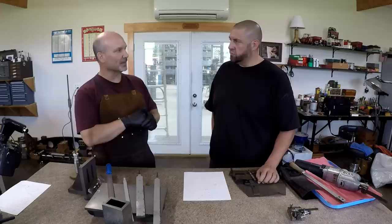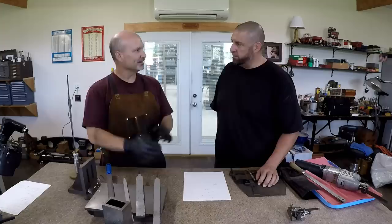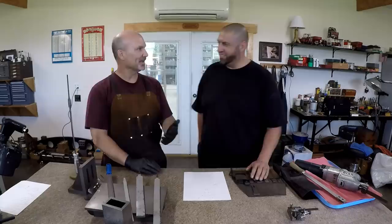I kind of stopped at 30 to 35. You're not going to use that a lot. Yeah. And it had like 60% or more contact, and it was in a nice flat plane. So that's good enough. If I made it 50 or 60 points, which would be crazy tough to do, it wouldn't be any better than it is. So, yeah.